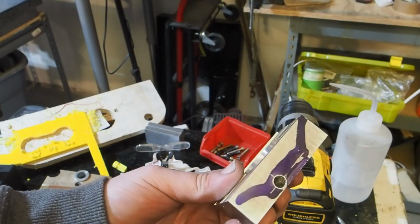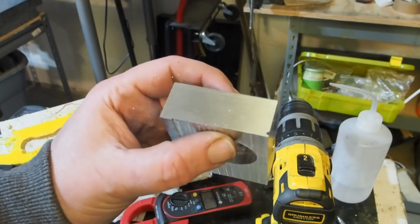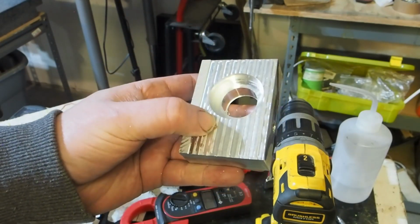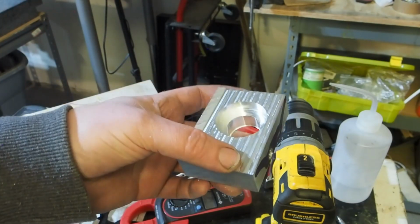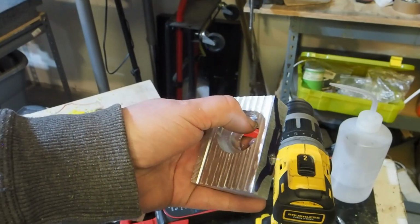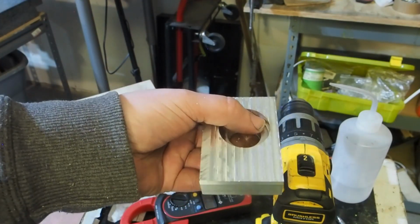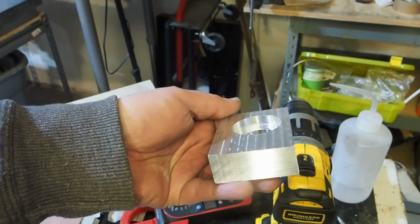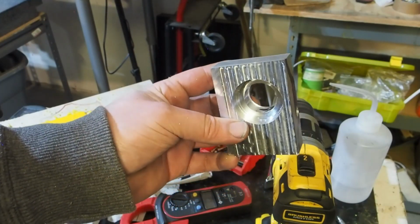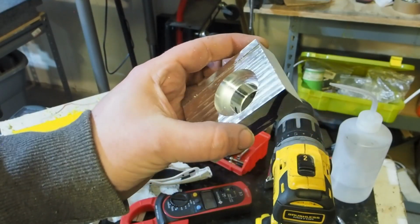But the surface finish actually looks good inside, not on this facing job. I really don't know what happened there. It's just completely inconsistent. Lots of cutter deflection, I guess. But even the roughing cutter surface finish isn't that bad. But yeah, I think this final bore, it looks good. It's just not round. So will the part work? Yeah, I don't have to throw it in the trash, but it's not a good part,